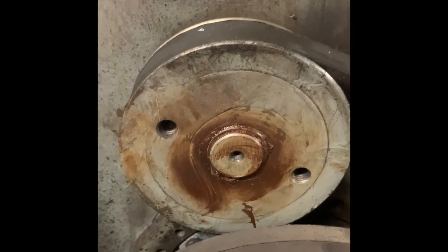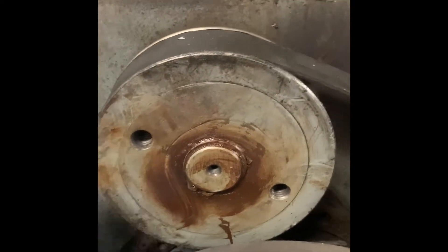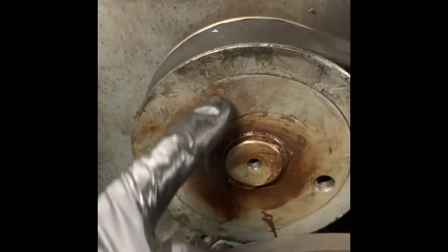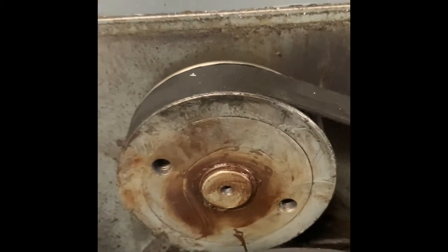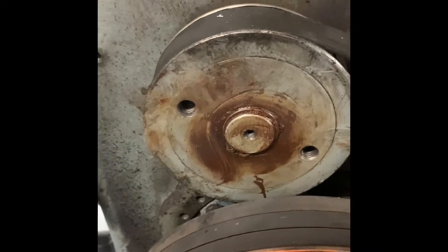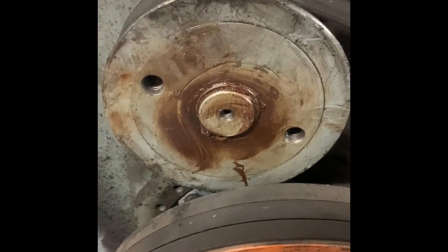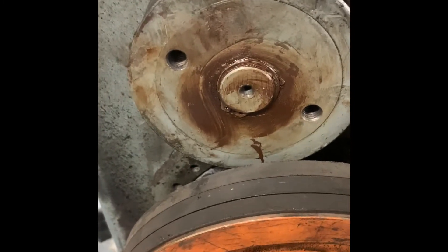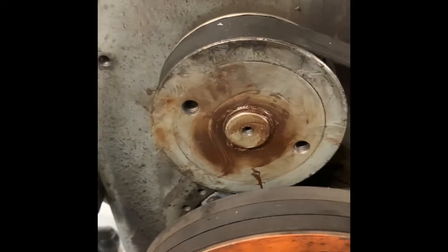Over time that's going to beat around the shaft, making the shaft smaller and the pulley inside diameter bigger, and then you're going to have a big issue. The key will also get worn out. Sometimes you can replace the key and that fixes the problem, but if you're more than just a thou or two worn inside the pulley, everything's got to be replaced. I've even seen guys weld this pulley to the shaft — I've gotten machines in where it's welded and then it's impossible to take apart. Best fix for this stuff is always new parts, though I'll do a bushing depending on the situation. The best scenario is to alleviate the headache — buy new parts or buy a machine from Machine Tools Rebuilt.